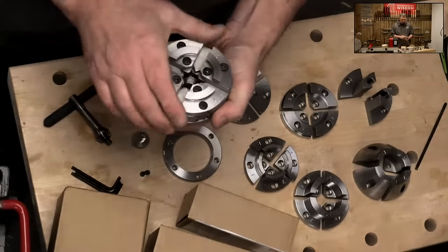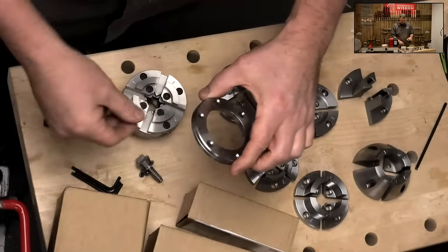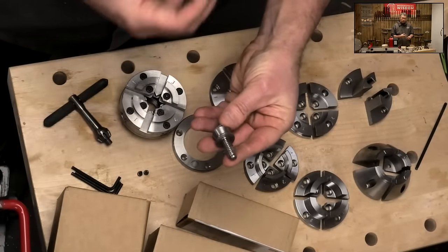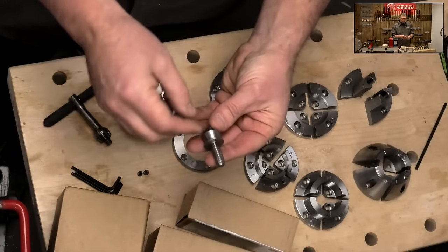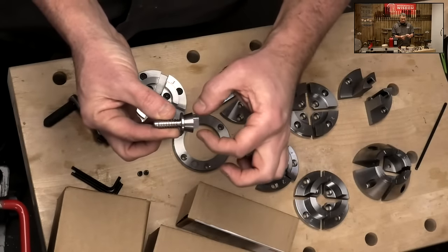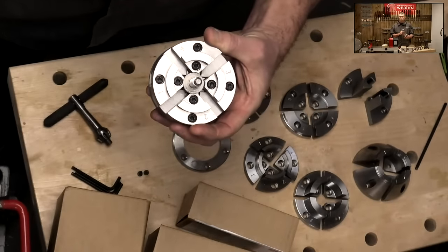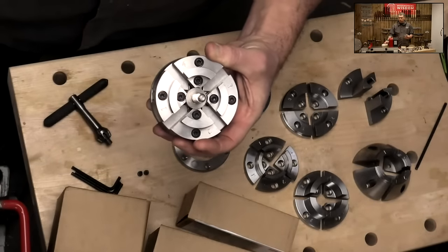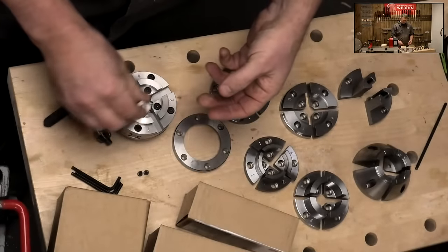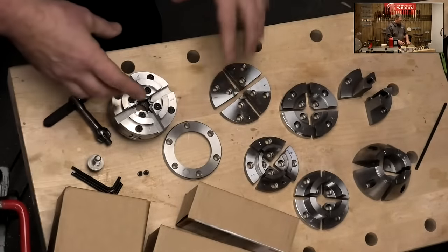The E jaws come with the kit, and also ready to fit is a faceplate ring for your bowl turning. And then there's the slightly redesigned screw chuck — a smaller piece of kit, keeping costs down for this chuck and the workshop range. The material blank has a dovetail and a little locating square socket that when placed inside the chuck rests nicely and screws up tight.